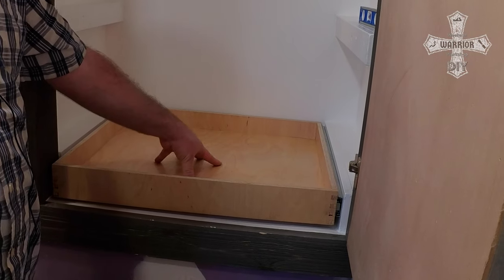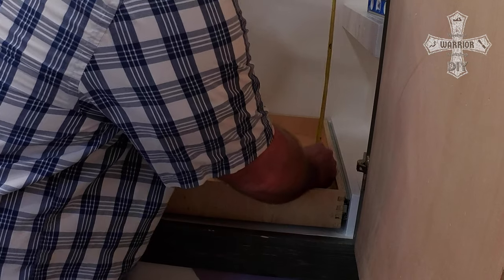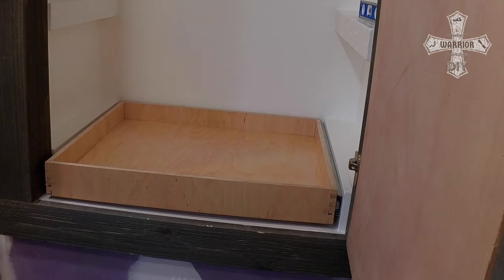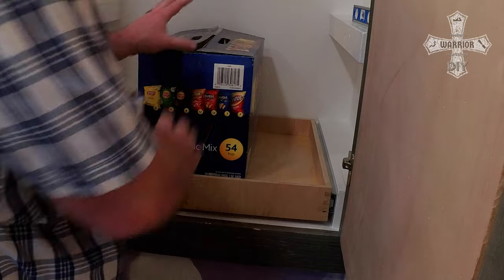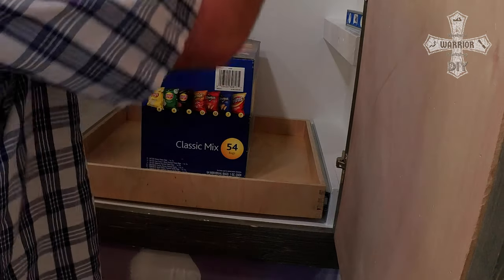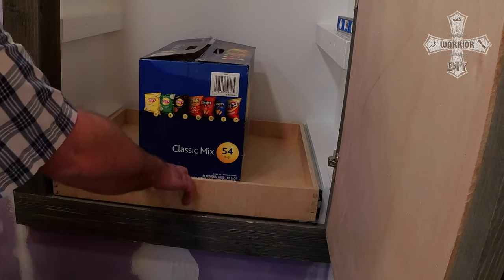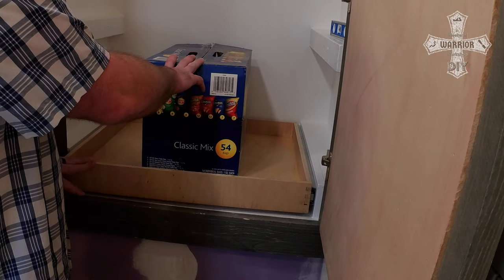We have the bottom drawer installed. Now I want to focus on getting the next drawer set up. I was wanting a 12-inch clearance from the top of this shelf to the bottom of the next one. I found a box I use for storage — I store tile sponges, rags, smaller tools in it — and it's 12 inches. By setting something in there at the height you need, I can set my second drawer on top of it. This helps hold it and even when you slide the drawer out, it helps carry the drawer out and keep everything parallel.